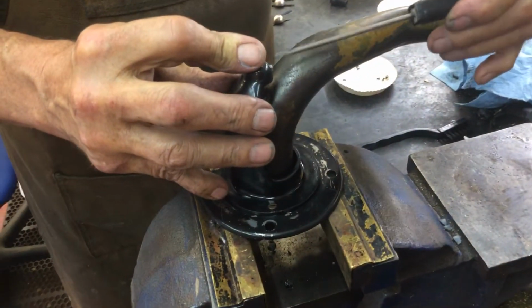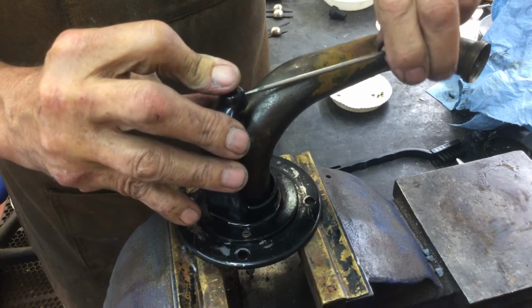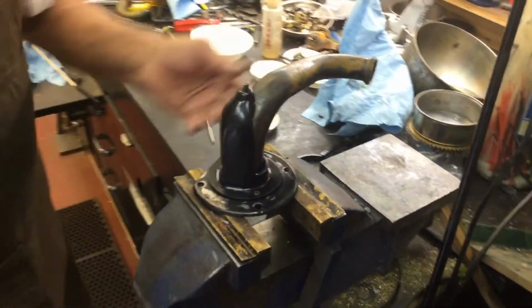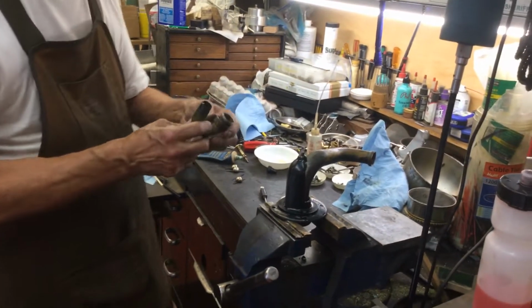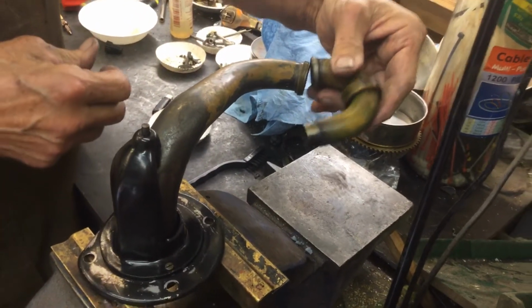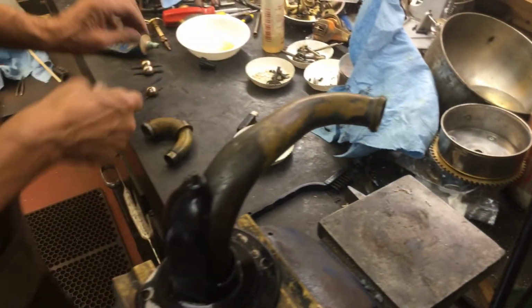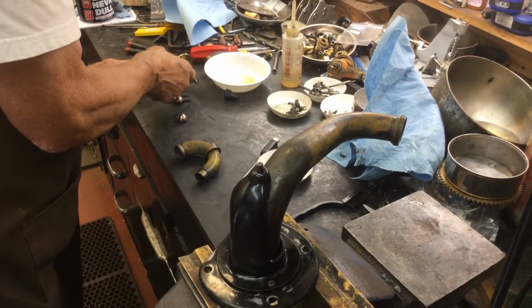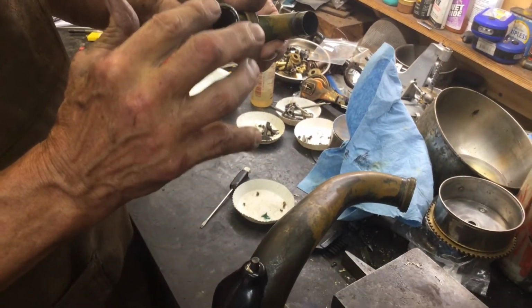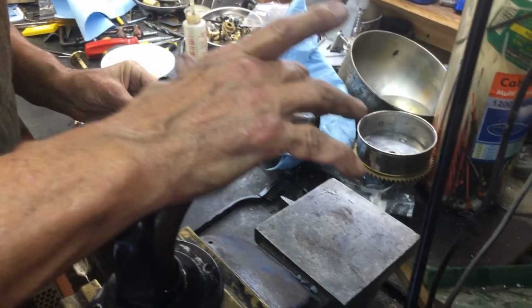Now what are you doing? Now we put the set screw that's at the end, the top here. We tighten that up. Now you have it all together, and that moves smoothly. Now one other thing, when you put the reproducer yoke on, right here, it has a running bearing surface here and a running bearing surface here. You want to just put a little bit of wheel bearing grease on there. Wipe that excess off. And just a pinch on the screw.